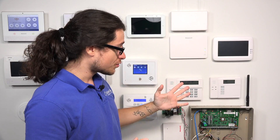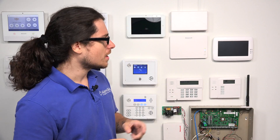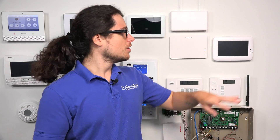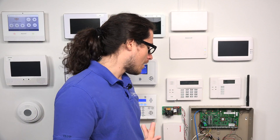For the AUI or touchscreen keypads, you can have up to four of those. Examples would be the Tux, Tuxedo, Tuxedo Touch Wi-Fi, the 6280, or Total Connect — which even counts as one as well. Total Connect is basically the remote application you'll be set up with for monitoring, accessible on a smartphone, tablet, or website. It allows you to remotely arm and disarm the system, get notifications, and set up Z-Wave scenes. So if you have Total Connect, you can really only use three physical touchscreen keypads. It's either four touchscreen keypads or three if you have Total Connect.